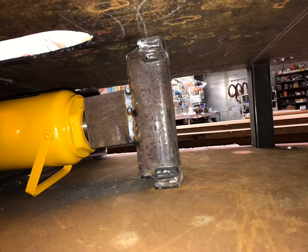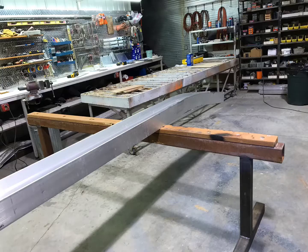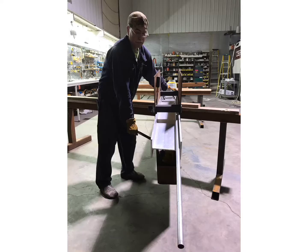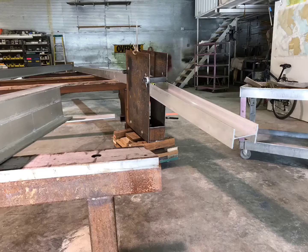This is the 30-ton jack bending unit that I built. The first piece I only bent it in three sections, six inches apart, and it was too tight, so I had a little dimple. The next ones were all four-section bends — much better.